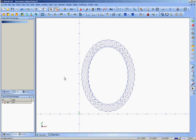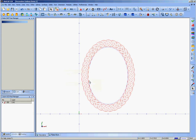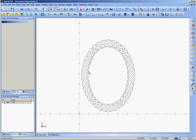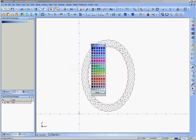One of the things you want to do at this point is start considering how you're going to be selecting and grabbing things. You can use layers and assign each of these elements to a separate layer, but there's another thing that's pretty easy to use. If you select something and go to Modify Attributes, layer is one of the things you can change it to, but color is another. So I'm going to go to Modify Attributes, color, and change from blue to black. I'm going to do the same thing with the ellipse — Modify Attributes, color — and change it to purple.